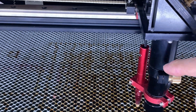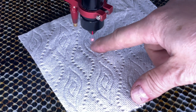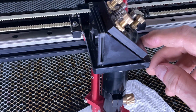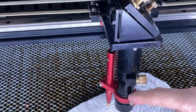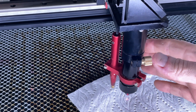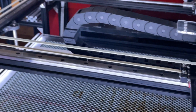The light passes down through the tube, hits the lens and focuses. You can see the red dot that started way back at the tube is now coming out the head, pretty close to the center of the tube. I'll show you how to do an adjustment and calibration in another video. At this point, we can move the beam left, right, forward, and back, and with the optics in place we could actually fire a test. I won't fire a test for now — we'll pretend everything is out of alignment and I'll show you how to fix it in the future.